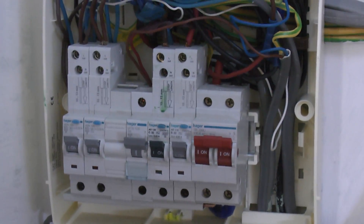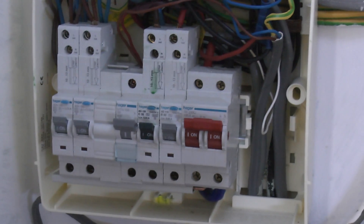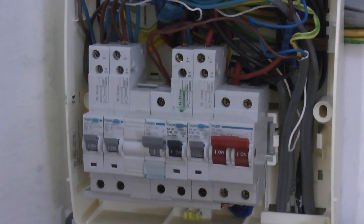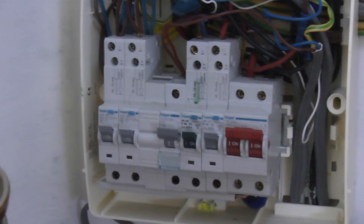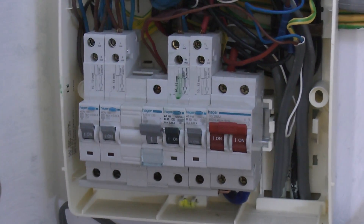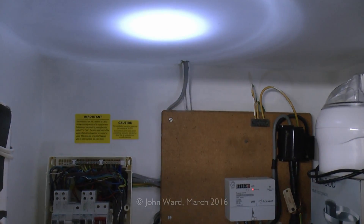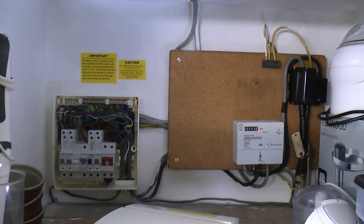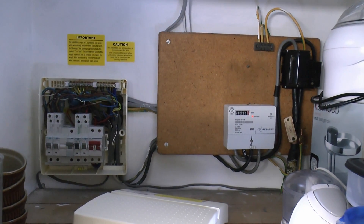You can still buy this type of arrangement, called a main switch unit, because when you buy it it comes with just the main switch and you buy the other devices separately. These days you would essentially put RCBOs in for all the circuits because RCD protection is pretty much required for everything — mainly due to cables being concealed in walls. This particular one has no RCBO or RCD protection on the lighting circuit, which is that central 6-amp circuit breaker, purely because it's an older installation where such a thing was not required. This is actually in the corner of a kitchen — very high up in a fairly inconvenient place — and to get to it I had to remove a whole pile of stuff from the cupboard, which is certainly not ideal but unfortunately a very common situation.